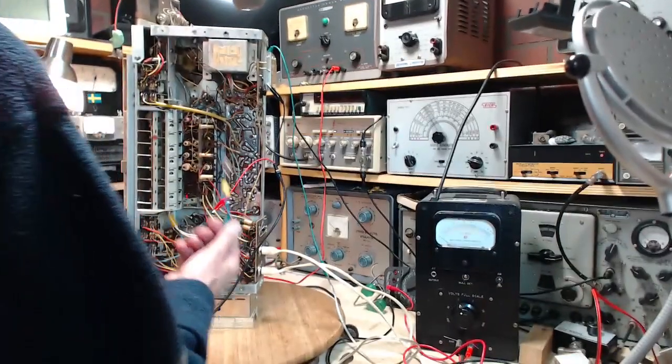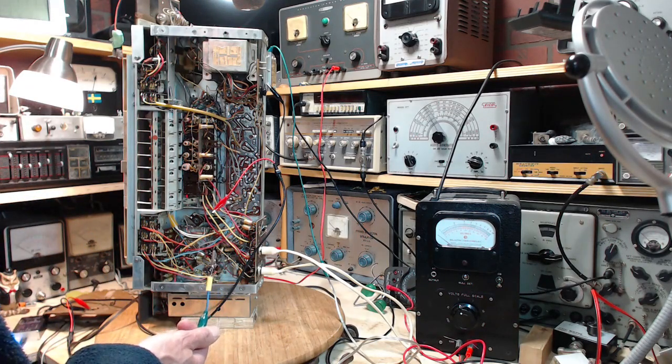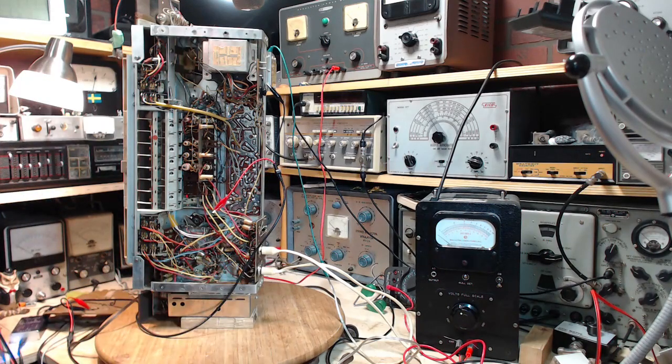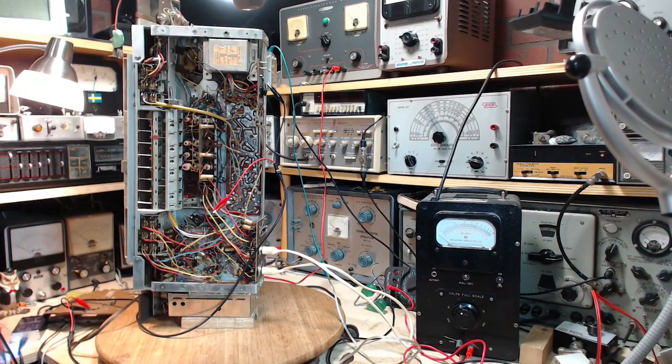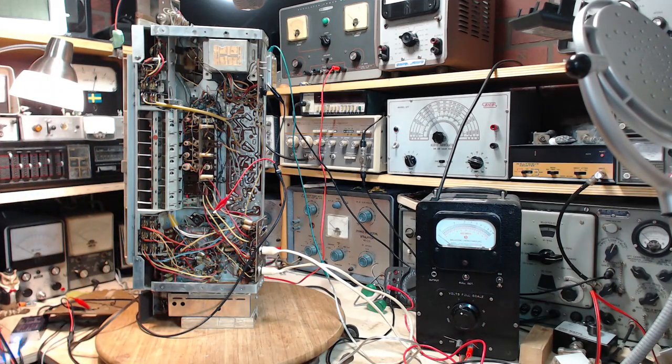So I'm going to use a capacitor, of course, and I want to block the high voltage that's on the plate from getting to my SDR, or that'll be the end of the SDR. These SDR radios are cheap enough that if you blow one up, just buy another. They're that cheap. I think I paid $25 for this thing. Software was free.